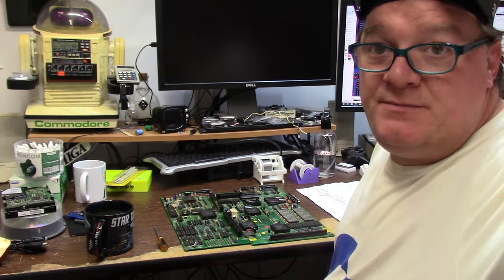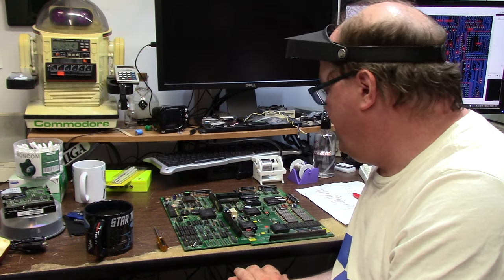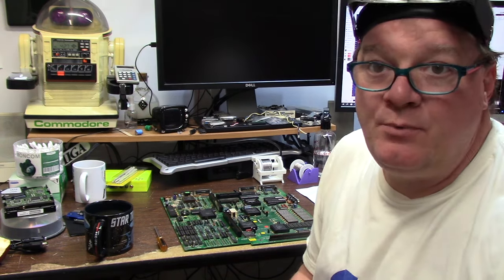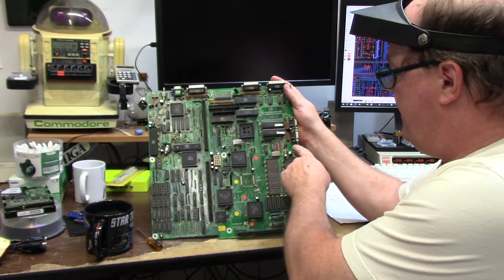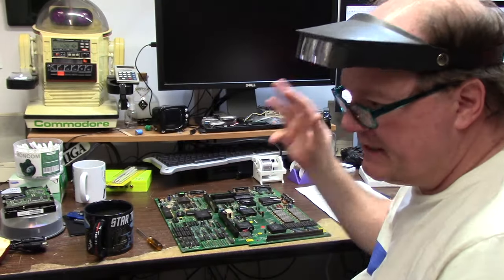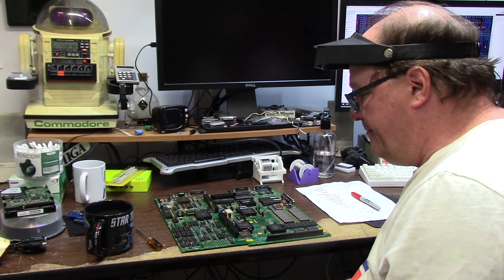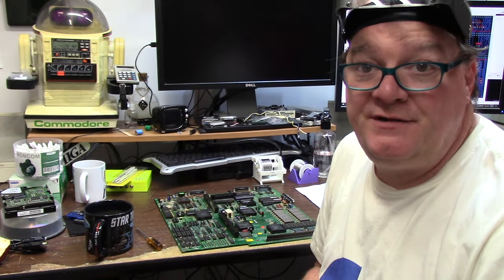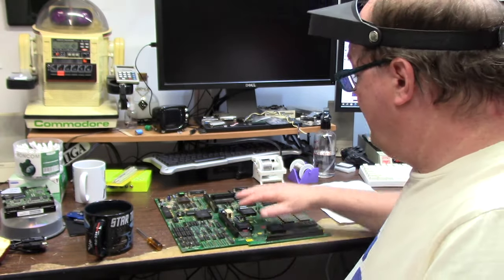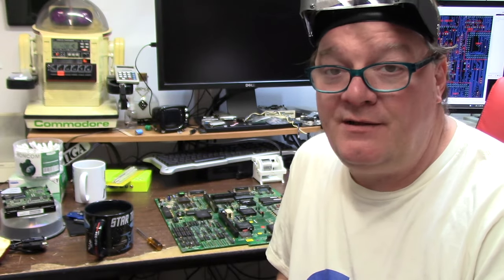I don't know what. So that is Amiga 3000 from hell, 2022-2023, and it's taken me that long to get chips because things are expensive. I need a keyboard connector too. I didn't even see that. Luckily, these are standard 5-DIN PC type keyboards, 4 pins and a ground being the 5-DIN. I can get those. It might not match 100%, but function over fashion at this point, baby. When she's all tucked away and's got her bloomers pulled up, you're never even gonna know how hairy she's gonna be underneath. So that is where I'm at on Project LT 3000.